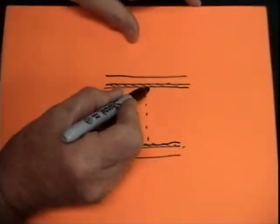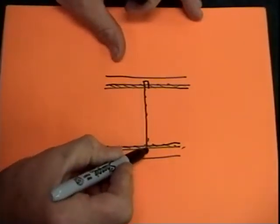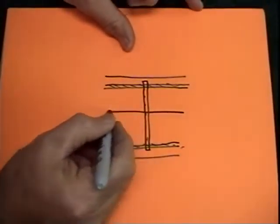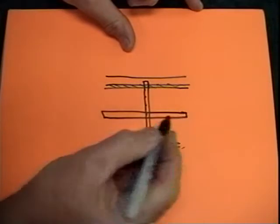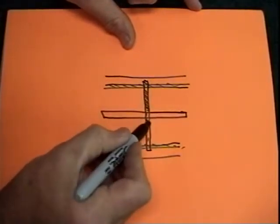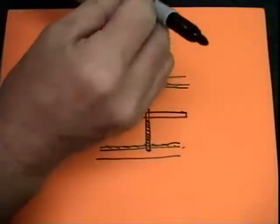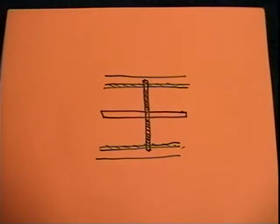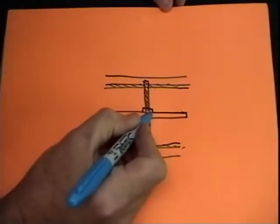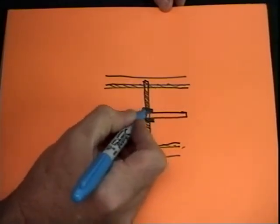they've got a piece of threaded rod, and it goes up over here through the plywood. The bell crank rides in here, and this is a threaded rod. Now, here's what they did that I think we can upgrade ourselves. We don't even have to wait for them. The standard way is they have a nut here. I don't know if there's a bushing in there or not, but this is a standard nut on each side, and that's perfectly okay.